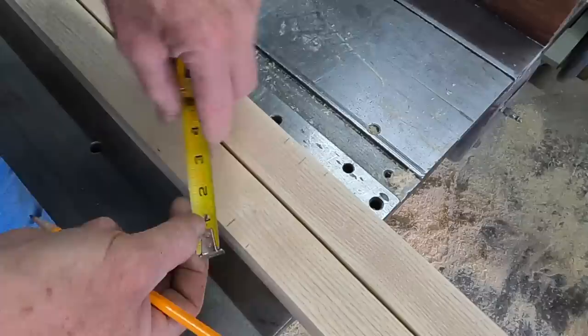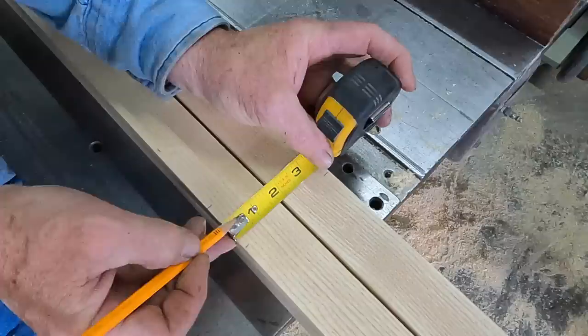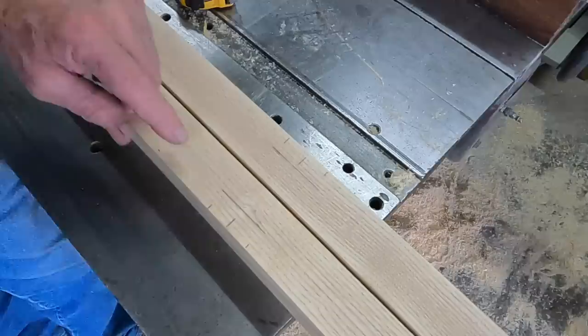And these bows are 1 inch thick, but I'm not going to go a full inch deep. I'm going to put a little bit of a shoulder on those. I might cut these to, maybe I'll do 3/4, give me a 1/4 inch shoulder for these bows to be jointed into this lateral. So these joints I can do on the table saw.